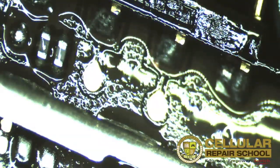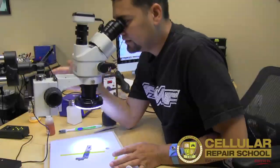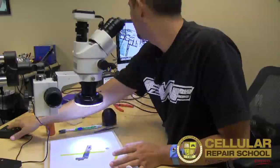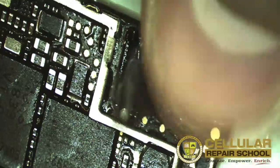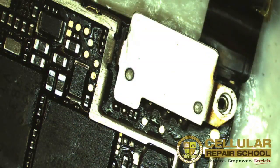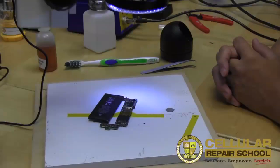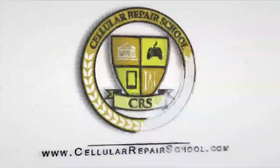You can see the areas where I soldered. We've got good wetting — it is somewhat of a volcano shape, which is good; that means we have proper wetting. It is all soldered together. Let's test this out to make sure we didn't damage the battery terminal as we reflowed it back onto the board. Let's connect the battery — and the battery is connected, as you can see. That's how you successfully salvage a part from another unit and put it back on the unit you're replacing the part on. Thank you for tuning into Cellular Repair School; we'll see you in the next video.